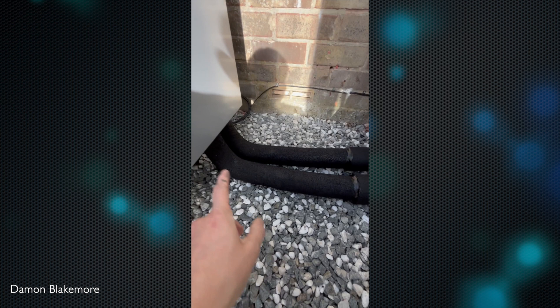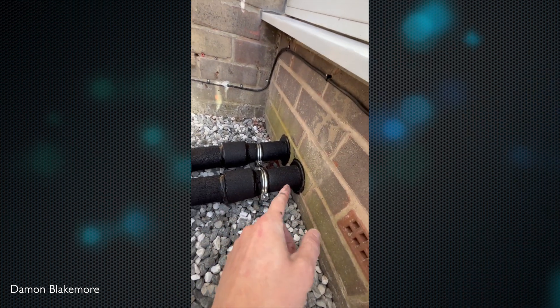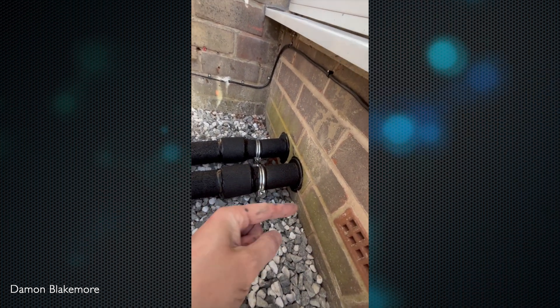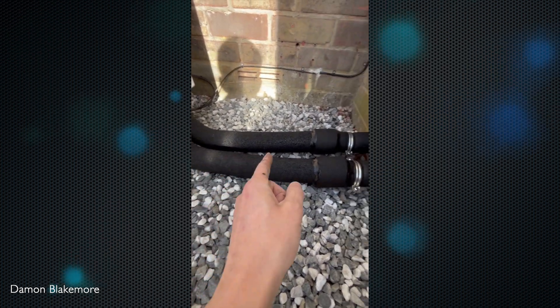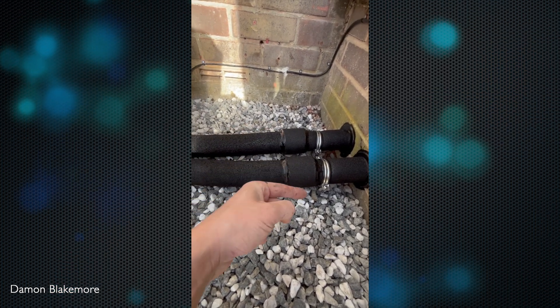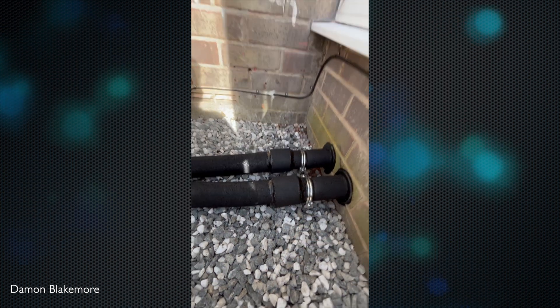Primary flow with a maintenance coat — we've got sleeving, it's sealed, and then we've got the bonding rings on there. It's 28mm straight onto hoses, and that's 40mm at the connection where we've gone from hose to copper.